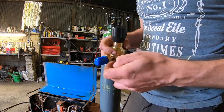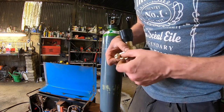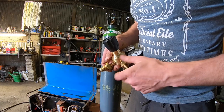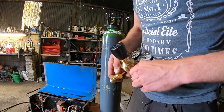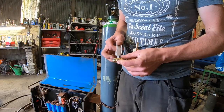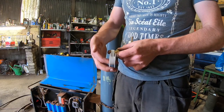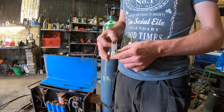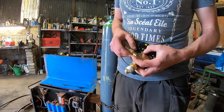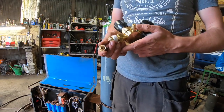I just never trust these fittings on any of these. If you're fitting any gas or anything like that, PTFE tape is nearly a must for most of them, because they tend to fail. They tend to leak, I should say. And leaking gas is very bad for business, because it's not cheap. So I think I'll put some tape on all of those joints, grab some tape. These fittings all tightened. Hopefully.